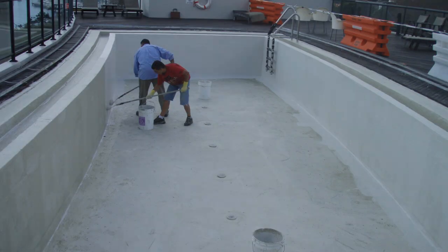Sometimes there are staircases or ladders integrated into the pool area, and you need to think about how you're going to seal around those. Don't use your standard sealants from bathroom or balcony applications in pool applications. Check out the best sealant manufacturers — there are pool-grade silicones that work very well — and make sure they're compatible with your membrane.